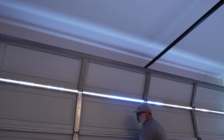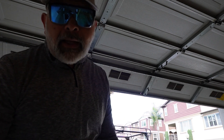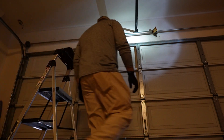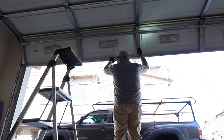Now the moment of truth — I'm going to open up the door. It's a little bottom heavy, but I think it's going to be okay. What I'm having to do is add a little bit more turns. I put my vice grip back up and I need to keep tension to the cables and to the drums so that way I can add probably another full turn and we should be okay. I just don't want to make this door too bottom heavy — I want to give it some good balance so they don't have troubles with it in the future. Much better balance now. Perfect.